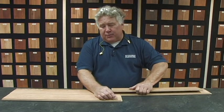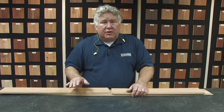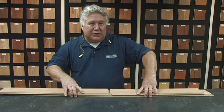What gives this end joint integrity is the long joint in the next row. Please make sure you have at least a 12-inch end joint stagger from row to row. Remember that all these floors are floating floors and they only gain their strength by locking together. They're never nailed or glued to the subfloor, so they count on the way that you install it — staggering the end joint from row to row to give the floating floor strength.